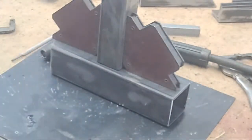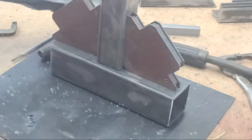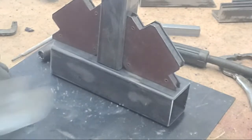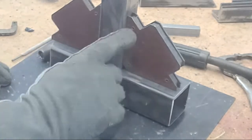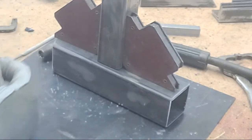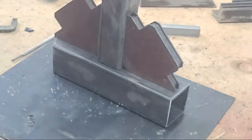When I was younger, we couldn't afford Detroit lockers or spider gears for the rear ends of our cars. So what we'd use was a high nickel rod to weld the spider gears together to make a solid chunk like an ATV axle — and that's just what we did for traction back in the old school days. I've got some thin wall tubing set up at 90 degrees, and I'm just going to make a couple of welds with the wire welder so you guys can get a grasp of how that's going to look.